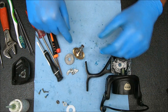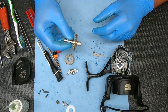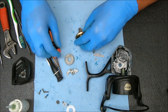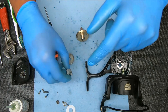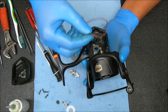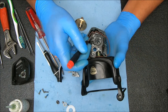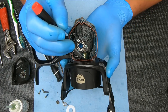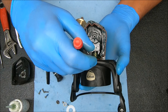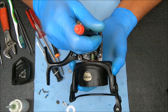Now this is the part where I'm going to grease these three pieces right here. I'm going to take this piece and secure it. I'll add some grease inside there where the handle interacts with the gear, and a little extra grease inside that little channel, as well as some on top of that post. Now I'm going to lay this in — I like to start at the top and work my way down. I use a small flat head screwdriver to help, basically whatever I need to make it work. The funny thing about these is that sometimes when you take them out, you may just need to put a new one in because it just doesn't reset properly, especially if it wasn't put on properly in the first place.